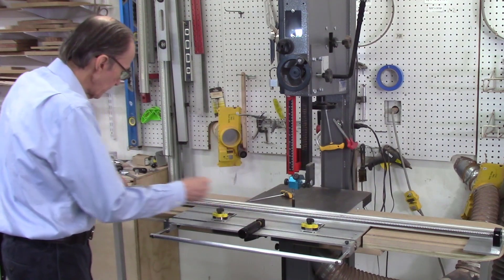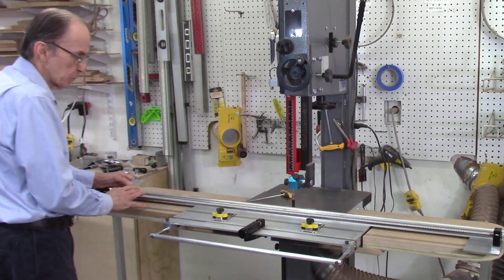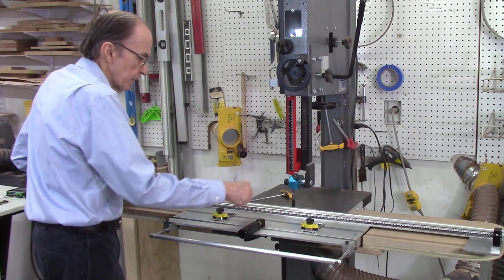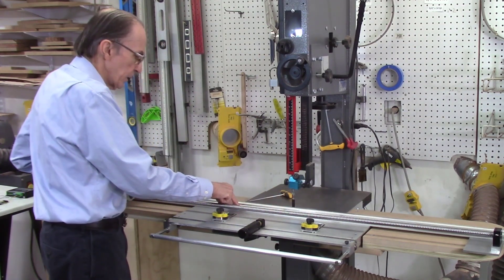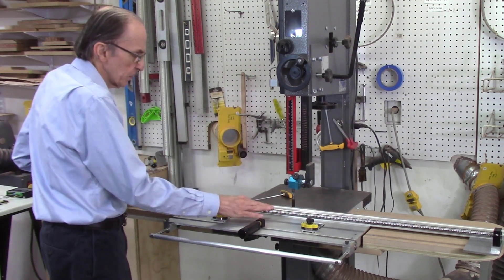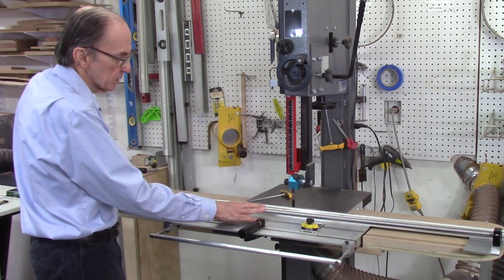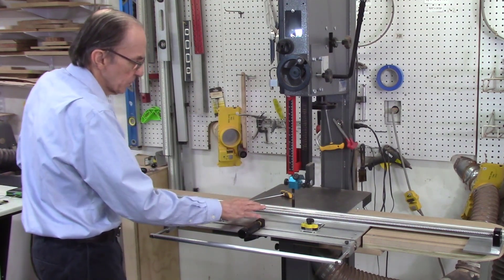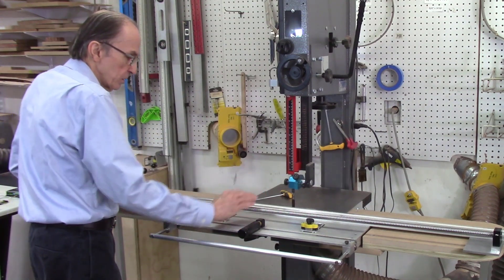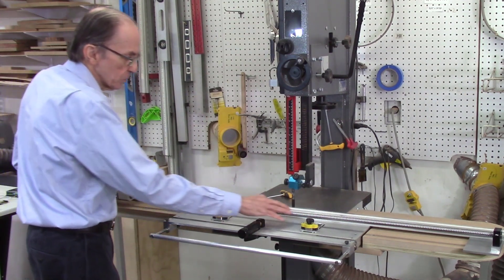The threaded bar system is where the plate rides, and that plate gets attached to the carriage to push it through the bandsaw blade. I considered putting the screw system inside the rail channel but it's too large, so I moved it outside the rail. In reality that's probably a better choice because it keeps the ball screw further from sawdust, though eventually I'll need to build a guard around it for safety.